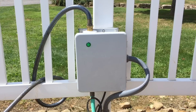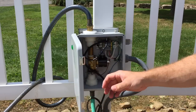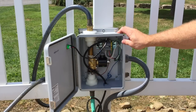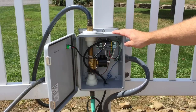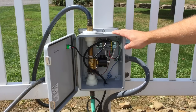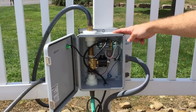This remote box controls the solenoid for filling as well as the level switch. Opening up the box, which is NEMA 4X, we can see from the conduit coming in we've got our fill sensor on terminal blocks headed back to the main pump control. We also have a solenoid — a 24-volt normally open solenoid — that fills at a little over 5.5 gallons per minute from the tap. I bought the solenoid on Amazon; it wasn't that expensive, maybe 40 bucks or so.